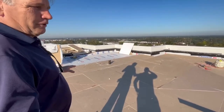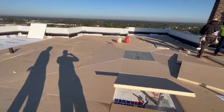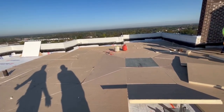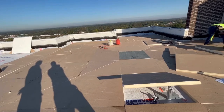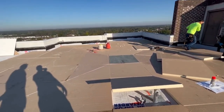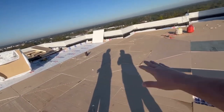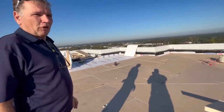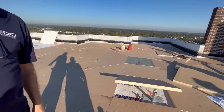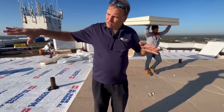Putting a jigsaw puzzle back in rows makes it quick and fast. We'll have this area tapered in about a little over an hour, and another hour or so to foam it all in, then they'll drop the dense deck — very efficient. The insulation R-value does change across the system: this is an average R-30 because it starts out at about a half-inch thick at the drain and by the time we get to the wall it'll be eight inches thick.